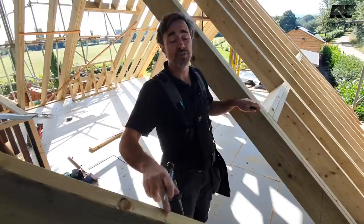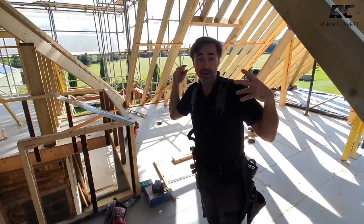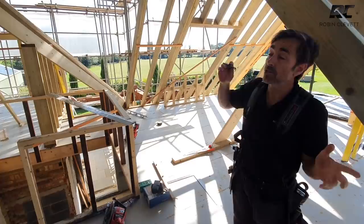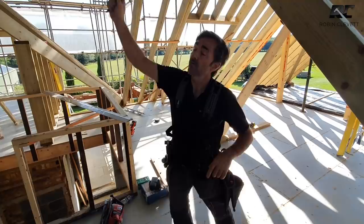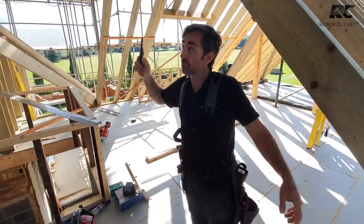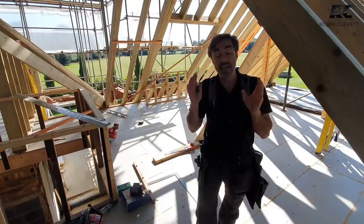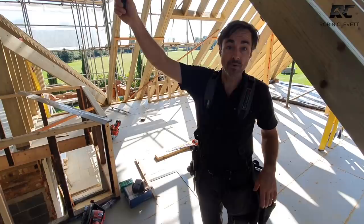So I've compiled a list of all of the material that I need to fill in all four corners of this valley. But what I'm going to do is cut two from one, because I've got long lengths, I can get the longest, and then I can get the reverse from the other end of it, the shortest. So I only do one jack cut at a time to gain two rafters. Because I can get a good yield out of the long lengths I've got, the smallest rafters at the top, I'm gonna cut those to the diminish, and I'm gonna fit them. Now, if they fit, then everything else is gonna be perfect, because they're the smallest, they go at the top. If there's any discrepancy with the centers or the measurements, it's all going to show there.